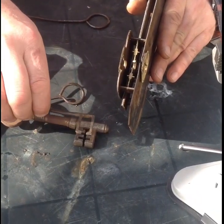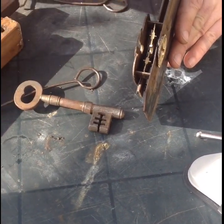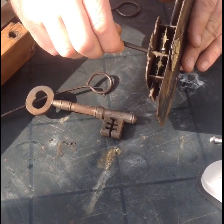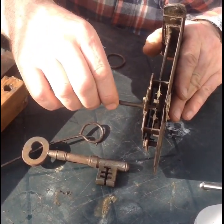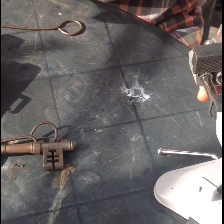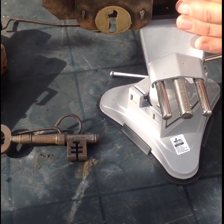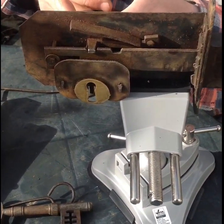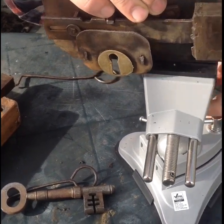This is a skeleton key that forms a sort of skeleton that negates the wards. Where it doesn't have to interrupt with them, it goes around the outside — so this is a true skeleton key. It goes into the keyway and goes around the wards without touching or needing to touch any of them. You'll be able to see how it goes around the wards and throws the bolt in a sort of snapping action, because the spring is really quite strong in this one. And that's how you open a warded lock with a skeleton key.